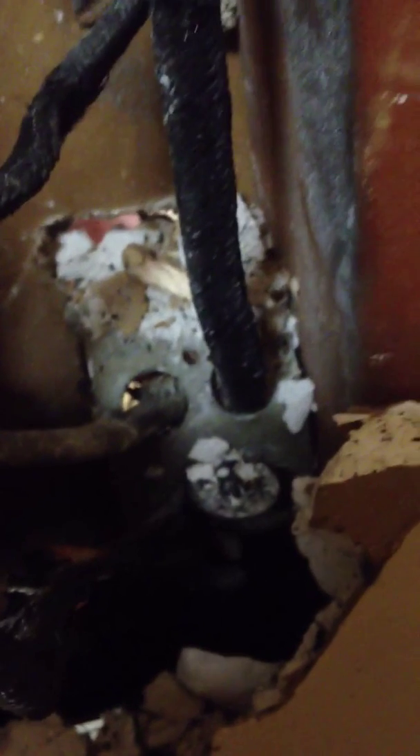The ground is not the same size as the other current-carrying conductors. Somehow, somewhere along the line, on the other side of this wall, inside this box, the neutrals are tied into the ground. You can see the burn mark scoring here. Somehow the ground wire got tied into the neutrals.